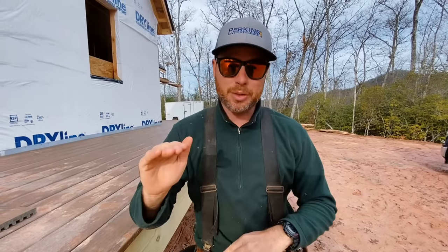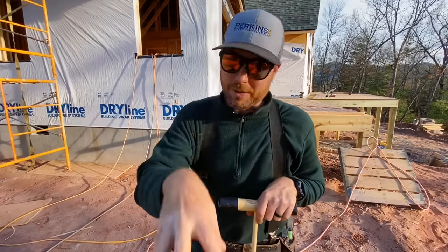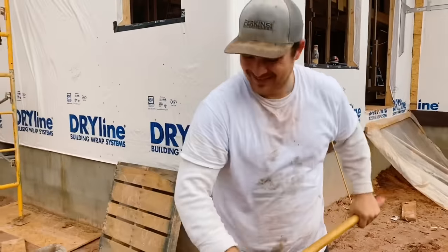One important thing is that your footings are the right depth below the top of the soil so that when the ground freezes, it doesn't push the footings up. In our area, you only have to be a foot below grade for this, but up north where it's a lot colder for a lot longer, you have to be way below grade with the bottom of your footings so they don't get pushed up by frozen ground. When we're digging footings for the whole house, we almost always use a 24-inch wide track hoe bucket. I'm okay with having footings that are a little wider than required so that we make sure the block actually hits the footing, because when you dig footings in the ground sometimes they wander because the track hoe bucket gets steered around by rocks and such. Can I dry pour it? No — you have to mix the concrete with water or it doesn't work. Don't pour the concrete in the ground dry.